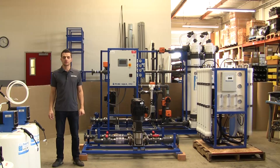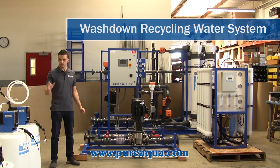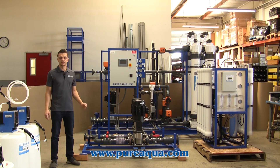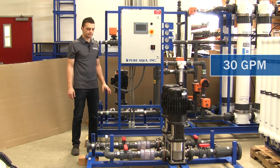We're at the world headquarters of PureAqua Inc. Production has completed the fabrication of a few systems for the application of water reuse after the processing of onions after they are harvested. We have an ultrafiltration system, a brackish water RO, a reject RO, chemical dosing systems, a CIP system, and a green sand and carbon filter. This system is going to the state of Idaho in the United States, and the overall capacity of the plant is about 30 gallons a minute.